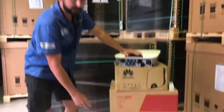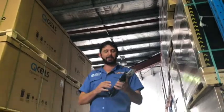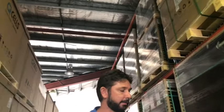The bigger thing — and where they're going to be competition for SolarEdge — is this little fella over here: the Huawei optimizer. We're going to be able to put these on every panel if we want to, making it direct competition to SolarEdge. We can optimize every single panel on your roof, read the output of every panel, and have every panel work individually. But what's possibly even more interesting is it will also compete with Tigo and Fronius — if you have say three panels shaded by a chimney or a tree, you can selectively deploy these optimizers and save money by only putting three on your roof. You can choose whether to pay a little bit more and monitor every individual panel's output, or not.